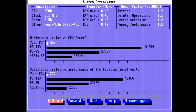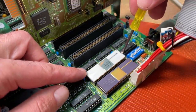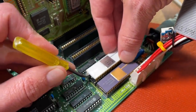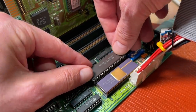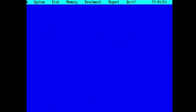We now have enough benchmarks from the 8088 and it's time to swap the CPUs. Using my self-made tool, I'm gently removing the beautiful white ceramic CPU to place in the NEC V20 chip. Now it's getting interesting with the benchmarks.